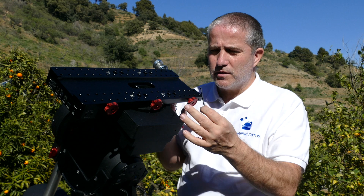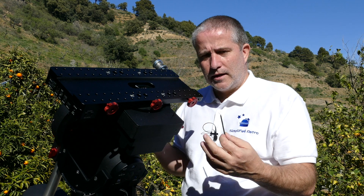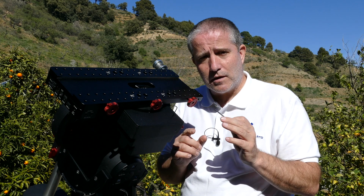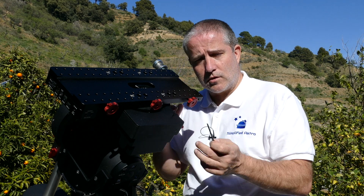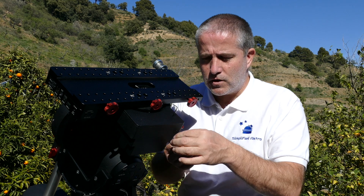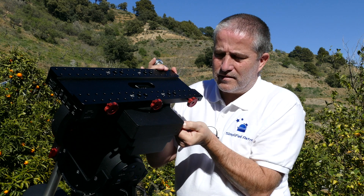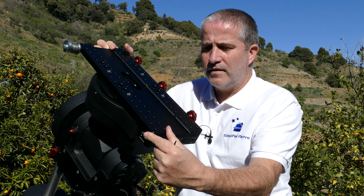The danger is going too far and binding up. Ideally you want to do this with your telescope on — it doesn't really matter too much, but perhaps with your telescope on and everything ready, and also with the handset plugged in. Once I've done this I'll check with my handset to make sure we get no binding, because it's a real fine balance between getting the gear meshed enough but not so much that you start binding as you try to turn. So again I'm putting my 3mm allen key in for just the tiniest of turns, then locking the grub screw up.